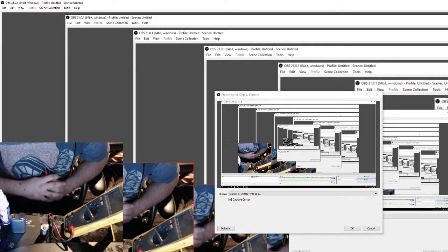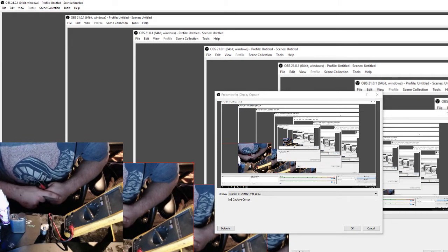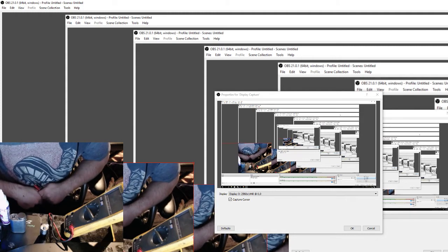But right before I did that, I volt tested my batteries. I did a baseline before I left the house today, and over the course of the day, I went from 4.14 volts on both these batteries, they are in parallel, to 3.84 volts. I'm pretty close to the optimal voltage on these guys. And I used this to confirm my findings. So I log this information. This is my AB rotation. I have my CD rotation in a very safe protective sleeve. Actually, it's a really nice little plastic case, I gotta admit.